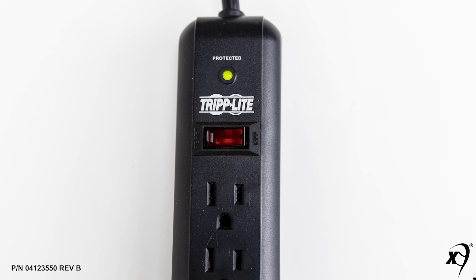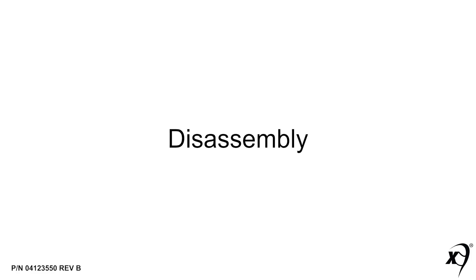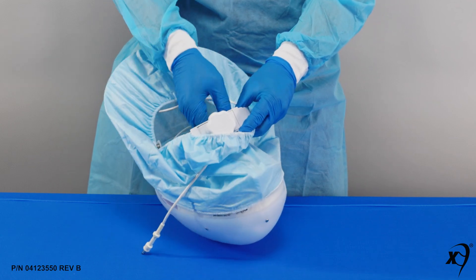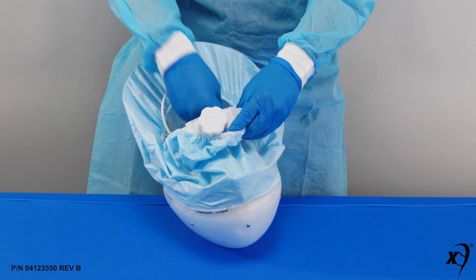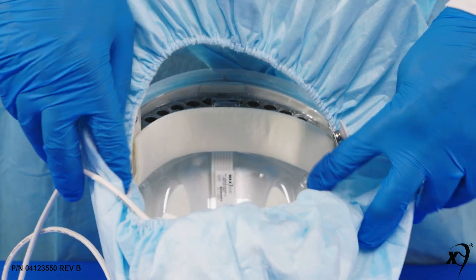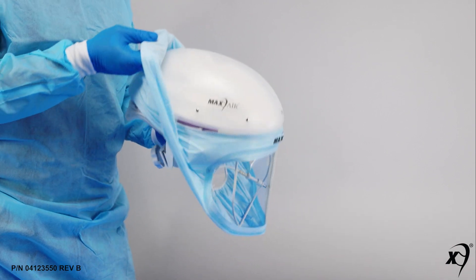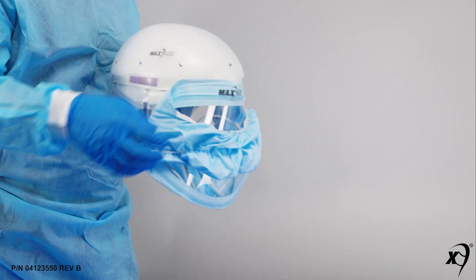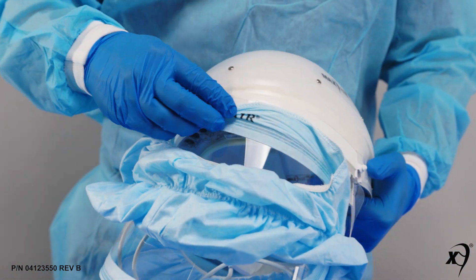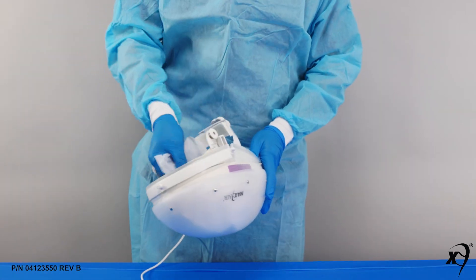With the charger connected to an appropriate surge protector, connect the charger cord to the battery. Pull the entire power cord back through the gaiter back button hole. Lift each side of the gaiter up and off each side hanger. Lift the gaiter back up and over the helmet towards the helmet front. Lift each gaiter side lens mounting hole off each FCC side mounting post. Turn the FCC front turn clip horizontal and lift the gaiter off and away from the helmet. Clean, ready, and store for its next use.